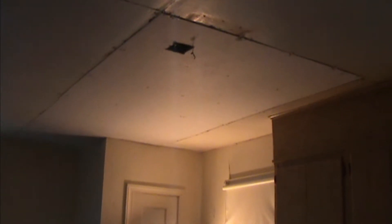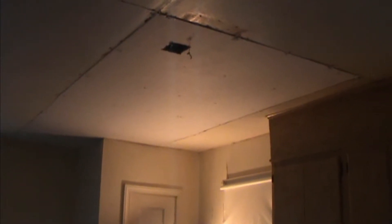We're just going to start in one place and rip it down — whatever comes down, comes down. As you can see, I got the drywall up. Finished up some nails and tomorrow I'll finish the spackling. Drywall is completely nailed, made sure all the nails were dimpled so I could spackle. Went through all the rest of the joints and cut it with a razor knife and scraped out all the drywall so I could re-spackle and re-tape all the joints properly.